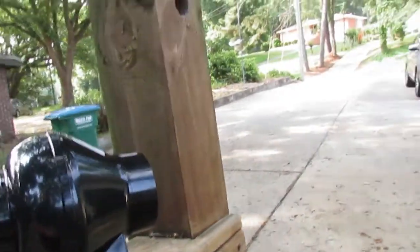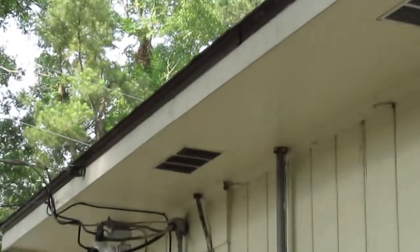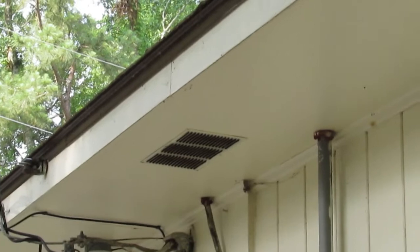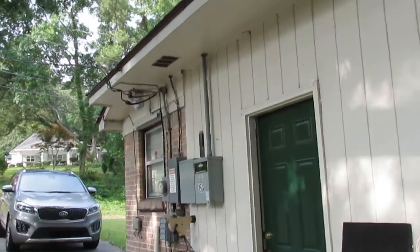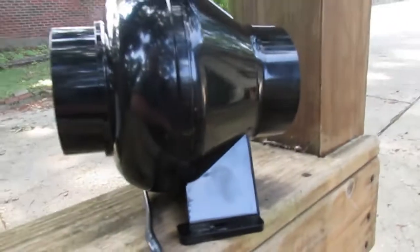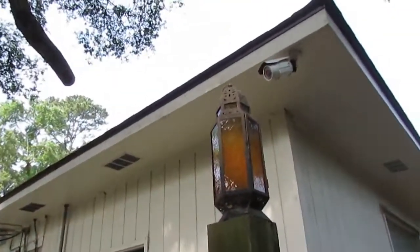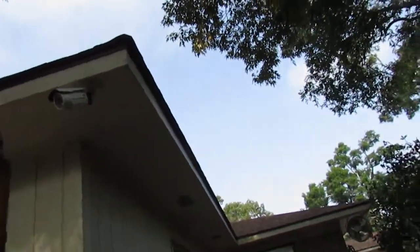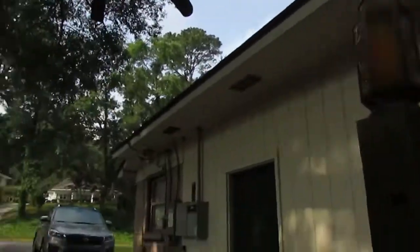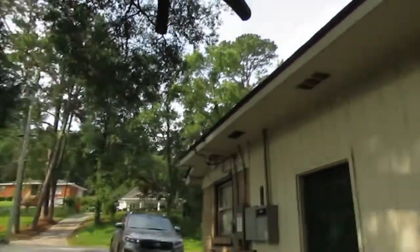The arrow is the direction of airflow on this. What I'm going to do is take off one of those soffit vents up there, probably that one right there since it's closest to the outlet, and I'm going to run the cord down the wall and put it to a timer so this thing will run from say 11 to 7 o'clock. Hopefully it'll force air from this lower soffit area over to this attic fan which is on the other side, which I installed a few weeks ago. I also have an episode on that — it's a Remington solar fan.